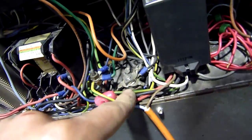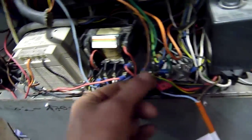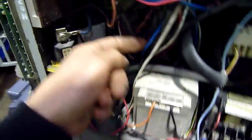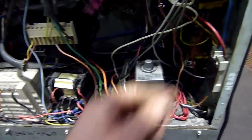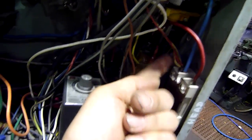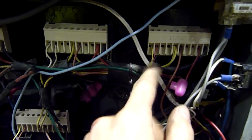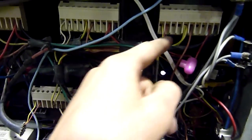I think that's our neutral bar down there. Those little wires just sort of soldered on top of some of the lugs — that's an earth. There'll be three different phases probably coming out of this main switch and they'll just split off to different places. It's all point to point; there's no common bus bar. So there's all these other — I think they're neutrals, or no, they're positives. So you've got power in and neutral, and then you've got relay switching and thermocouple on these controllers. It's interesting — it still works though.